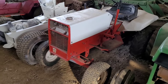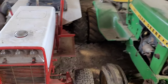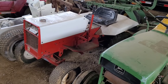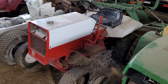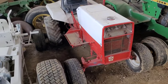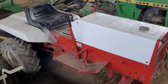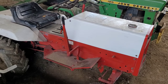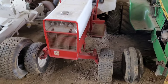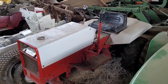This is a 1971 Gravely 432. I bought this spring. It was supposed to be rebuilt — I bought it from a kid who rebuilt the engine, someone else painted it, and he said it ran great. So I went and traded him a 110 for it, brought it home, and found out the governor in it is bad. I did rewire it on the channel. I'm either going to sell it or replace the governor — still haven't decided. It's been approaching a year. I really do like this tractor, but I don't really have time to replace the governor.